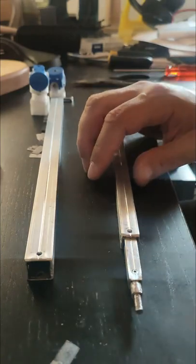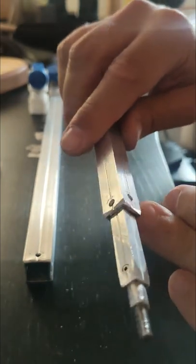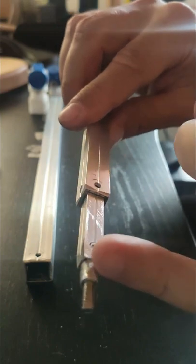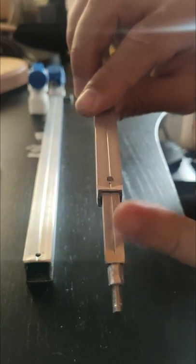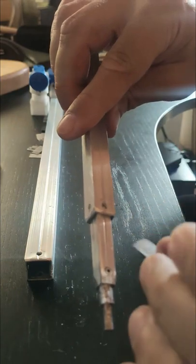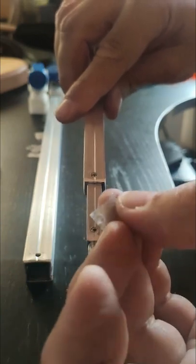I found a better strategy. I've got three of them in there already — two of them opposite. So start off with just one top and one bottom, or left and right — it doesn't matter. Fit them in, and I may need to re-file this to be a little more aggressive on the slope. For the third one, I had to re-file a little bit because the set screw was still sticking out slightly and causing issues.